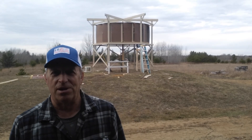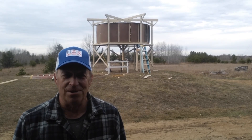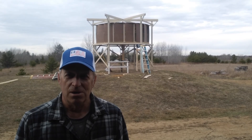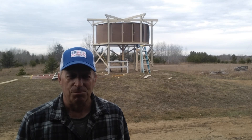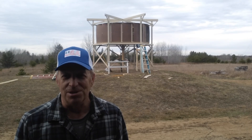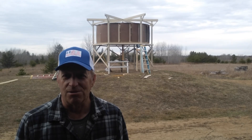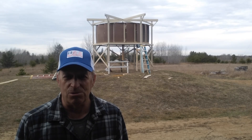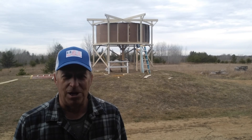The wind has kind of let up right now. But according to the online wind turbine calculator, a vertical axis wind turbine of this size in a 10-mile-an-hour wind would be generating about 69 watts of power — that's minus the losses of the turbine, plus additional losses for the generator. That's why I was talking about a 20-foot diameter, maybe 8-feet high version. If I had one that size right now it would probably generate around 231 watts. This is kind of like a feasibility study to see if I want to make a bigger one.